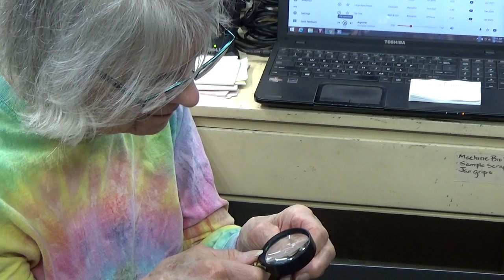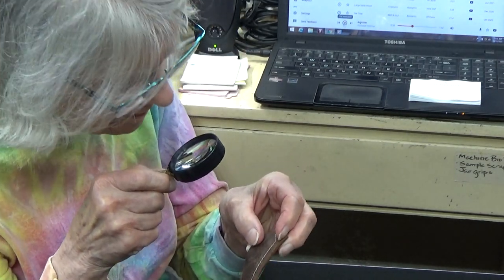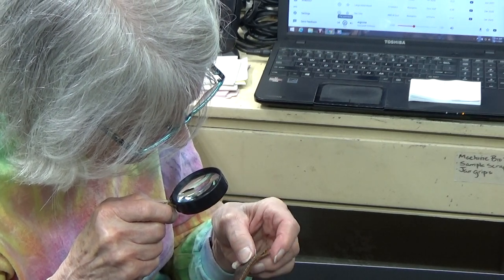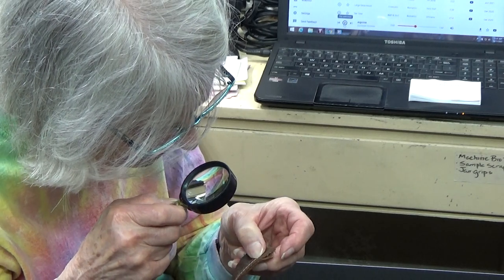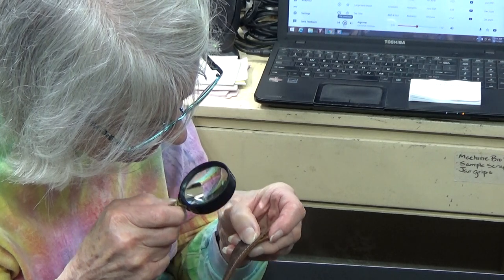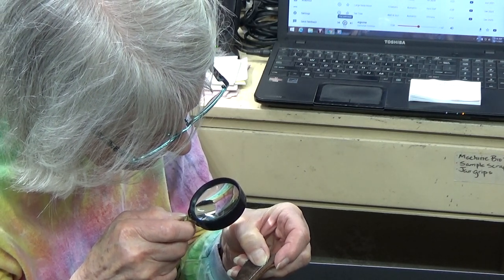So if that stitch is getting pulled up a little bit too hard for the lock stitch, then all you have to do is back off that upper tension just a little bit, and that stitch will be pulled up a little bit less hard. It's like a tug of war. If you're brand new to VSM, that upper tension is pulling up, that bobbin case is pulling down.